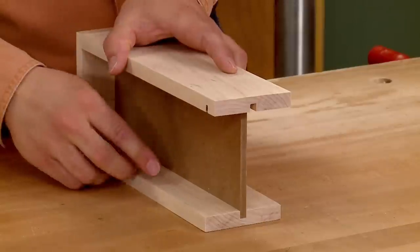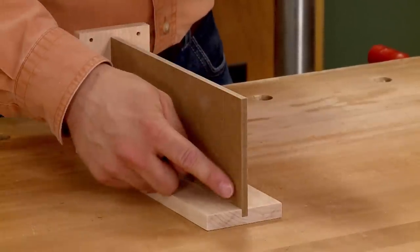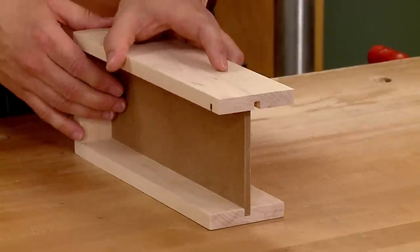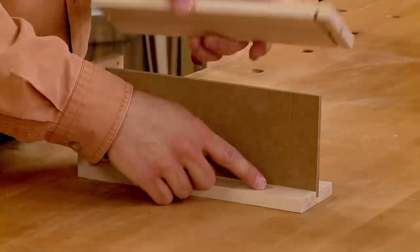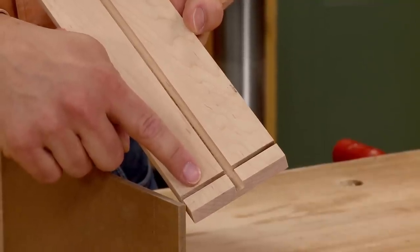The rack is made up of an I-beam construction. There's a vertical hardboard core that connects the bottom and the top piece. The top piece is a little bit longer than the bottom piece, and there's a narrow dado cut along the back of the top piece to hook over the wall rack.